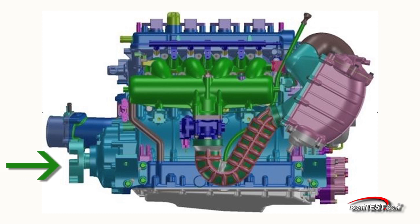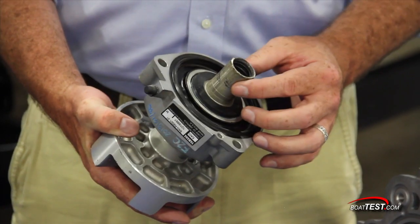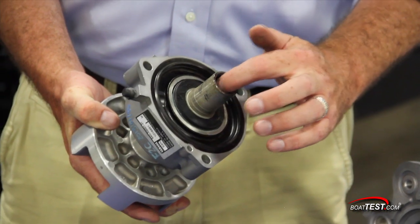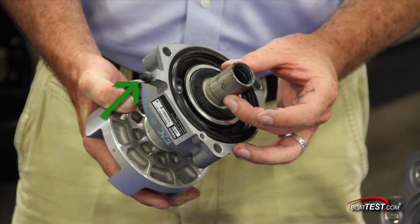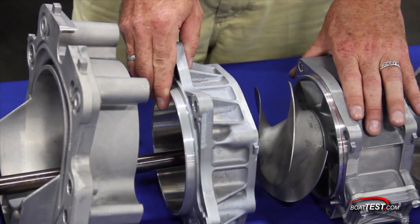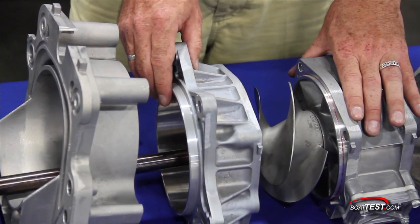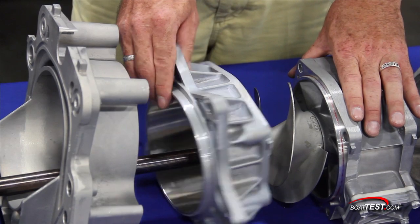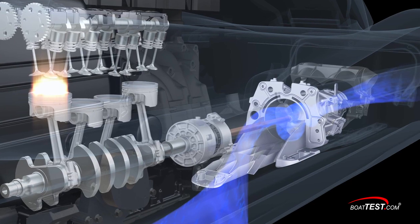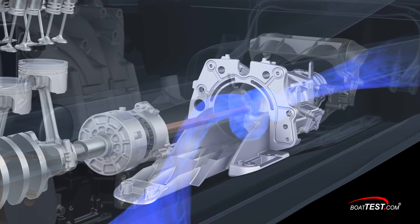This end of the unit has a flange that nests inside it. The coupling shaft is held at the other end by this large bearing housing bolted directly to the transom plate. Note how this bearing features a grease fitting for easy maintenance. The drive shaft is splined into the coupler shaft and rotates the fixed impeller within this impeller housing. The all-metal housing is made from an aircraft-grade aluminum alloy for durability and longevity of the pump's critical dimensions. Because the impeller and its housing work in unison, the tolerances between the two parts are critical to the output performance of the pump.